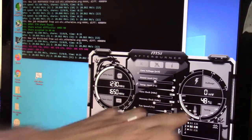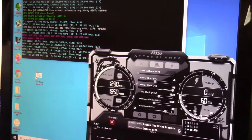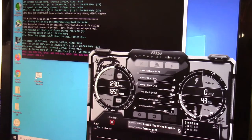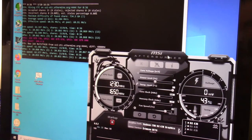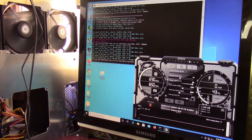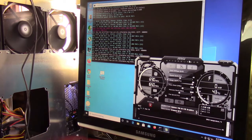After about half an hour, we're at 48 degrees Celsius — not bad at all. I'm probably going to switch the other one out as well because it's running at 60 degrees, though its fans look to be running well. The one I just repaired is 48-49, the one by the window is 43 — nice and cool. These were heavily used mining cards and they're serving me well. There you go — 120mm fans on some old graphics cards, running them actually cooler than they were. Thanks for watching, please like, subscribe and share.